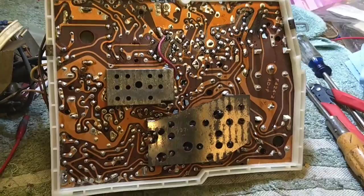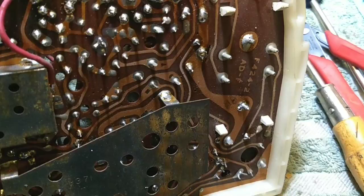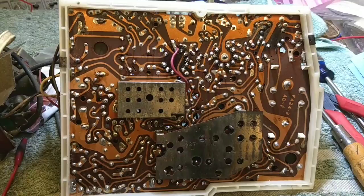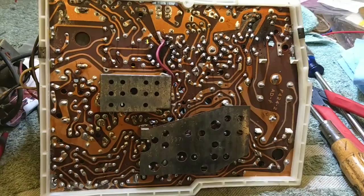I've got the board re-soldered — all the crucial connections that were touchy, all the tube sockets. I also replaced two capacitors up top: one was in the horizontal output, and the other one next to it was a .028 at 1,000 volts — that's probably our B-boost capacitor. So I put a .047 and .1 in series at 630 volts, which comes out to about .03 at 1,200 volts, so that should be good enough. I think I'm going to change the filter on this just because I plan on using it — it's a 50-year-old part.